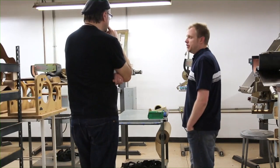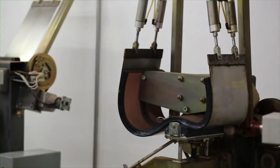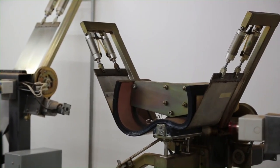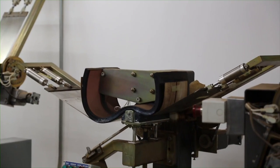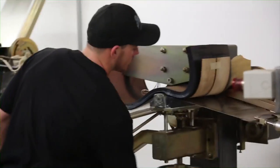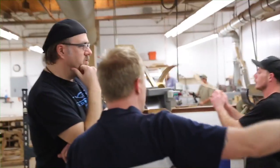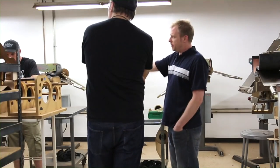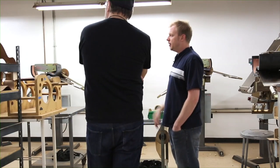We do still find considerable success and less breakage when we spray a little bit of water on some species of wood. This whole shoe has what we like to refer to as a heating blanket attached to it — that's the red rubber material you see all over these shoes. He loads it into its respective cooldown mold, and we place it there while the guitar cools down to help hold the shape.